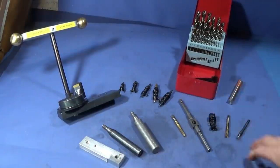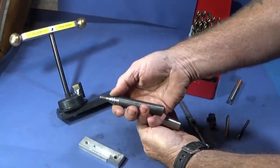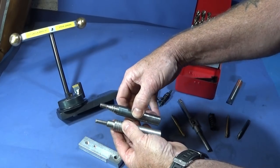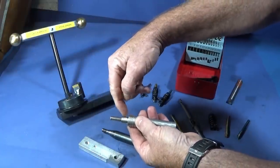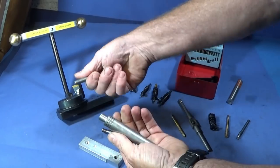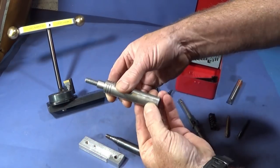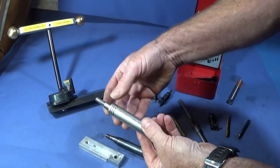Another thing about this mandrel is that the one I previously made with the die-cut thread on the end - obviously over time the thread can wear out, or you want to use it with a longer thread to make the ball further out from the component, which makes it much easier to turn. I've made this one with a thread stud in the end so you can actually change the thread, and it makes it much easier to make than the previous one. Over time I'll make up a set of these - it's worth having one with all the different thread sizes so you can use the mandrel for all different jobs apart from ball turning.